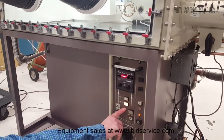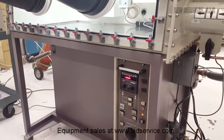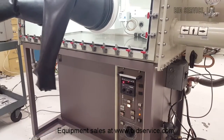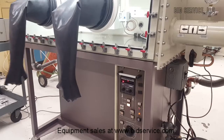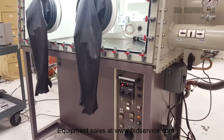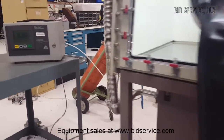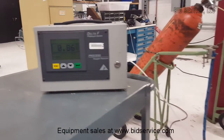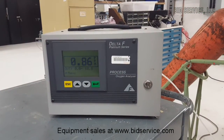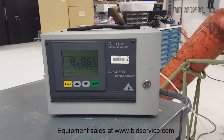You can see now the vacuum is on, so you're pulling the nitrogen out of the box until it gets into the range. Let me bring that down here — it will pull the gloves all the way in. If you notice over here, we have an O2 monitor hooked up to the system. This is our house unit that we use to verify that the system is operational. That's creating oxygen readings in parts per million — we're just under one right now.